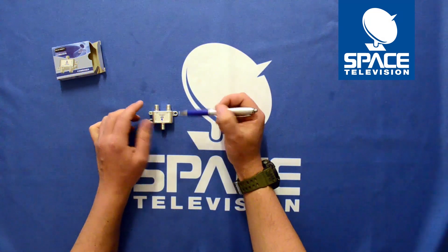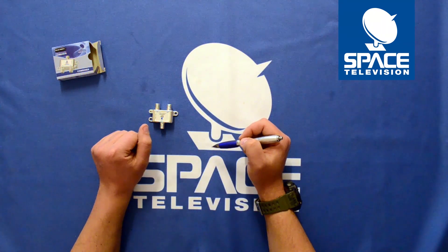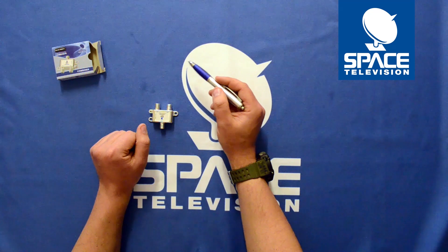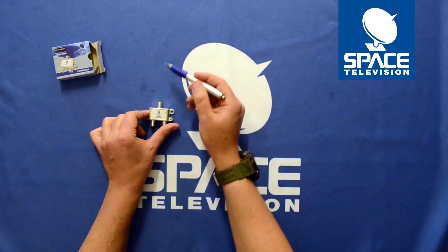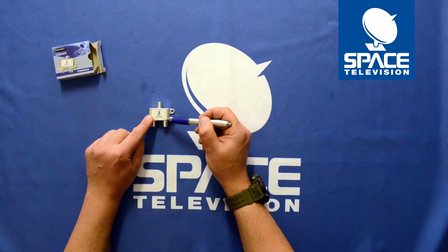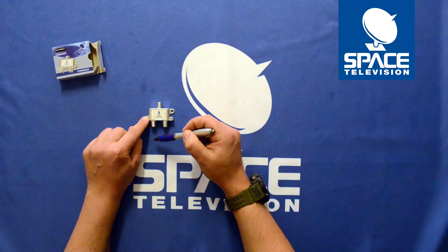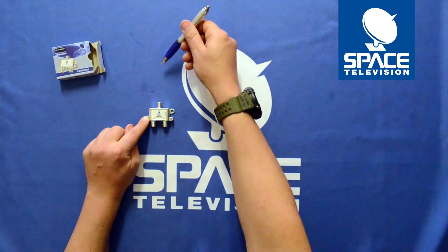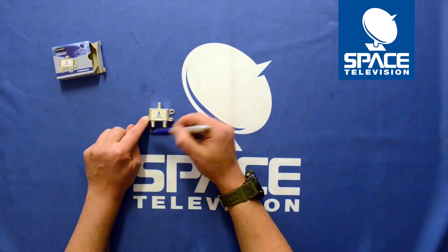If you're using it with a Model 4 decoder and you have your Explorer 3 as your primary, the cable from your Explorer 3 runs from the decoder all the way through to the smart LNB on the SATCR port. On the second SATCR port it runs down to the Model 4 decoder where you connect it here. That splits the satellite signal to run out to the SAT port on the decoder, and on the antenna port you connect into the RF in or RF out so that the heartbeat and satellite come down, then get split out to their respective ports.